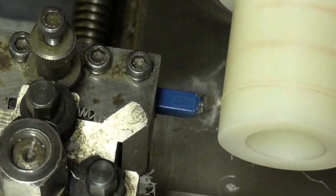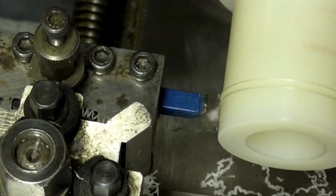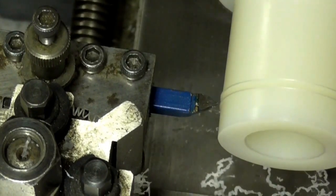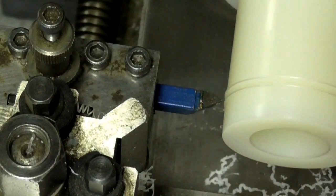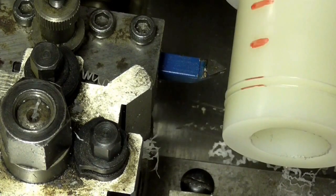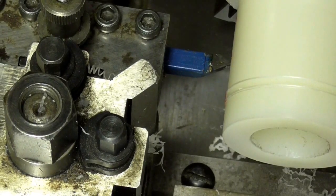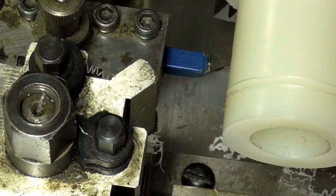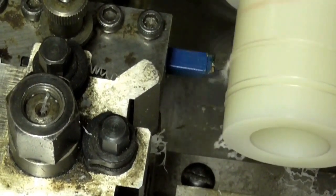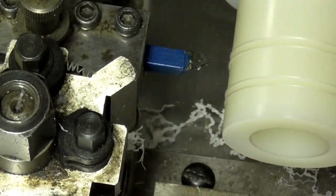What we're going to do now is begin to put in the grooves for the three guy wires. We're using a chamfer tool which has got an angle on both sides — this tool is incredibly sharp. It's a brazed type of lathe tool, meaning that triangular portion on the top is brazed to the rest of the tool. I've already marked them out at equidistant points — I did the middle one first and then marked the other two. We're cutting the second one here, and I've got the dial set so they're all at the same depth.